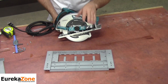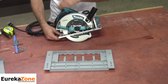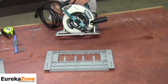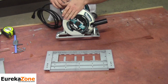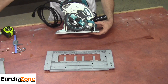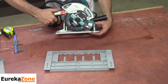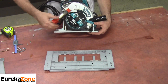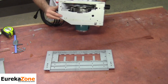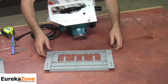The first step in installing the Smart Saw Base is to raise the blade to its highest position and lock it in place. Then take your blade guard, retract it to its furthest position, and use a small C-clamp to lock that blade guard so it doesn't close on you. From there, turn the saw over and get ready to install the Smart Base.